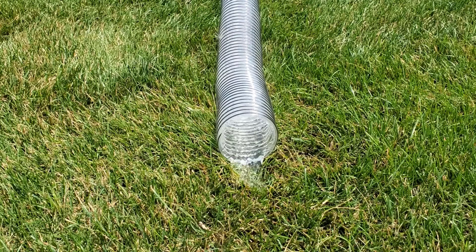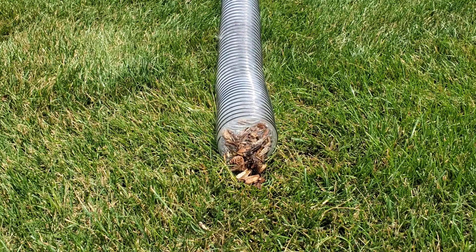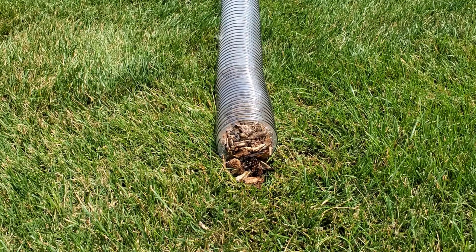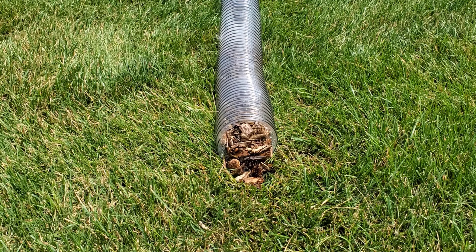It's gonna be bark, pine cones, annual flower leaves that aren't dried but are actually green and heavy. You can see that none of this is getting stuck in the ridges and valleys — that's what everybody wants to tell you happens with corrugated pipe. Notice that because of the belly, all the debris collects and gets caught up there — that's where failure lies, and that's on the installer, not on single wall corrugated pipe.